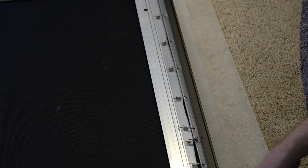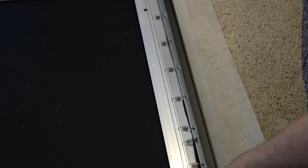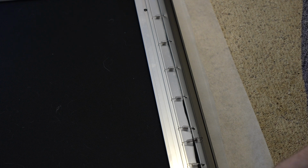4 inches down from this to my little brim I have, because I have a beam that I'm actually going to be pressing against. So 4 inches, it's actually a little bit less than 4 inches, but that's where we're at. And for this 110-inch screen, they're saying between this bracket here and the other bracket, the 2 top brackets, 59 inches. I'm going to be a little wider than that, because I'm going to go into the studs that I have. That puts me at 64.